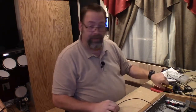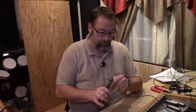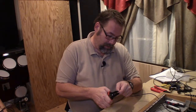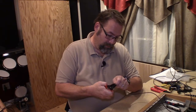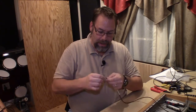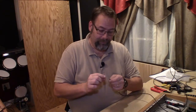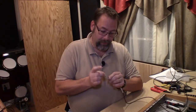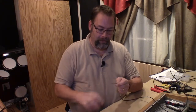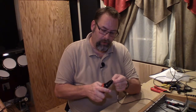You want to try to keep the table as clean as you can because it gets messy really fast, and when it's messy you can't find anything. Every time there's a little bit of trash, get it in the can. Now I'm going to strip the end of the wire — about an inch off the end of it. You could do more if you want; I find it's a little more comfortable to work at about an inch. Just cut it and pull it off. The thing about this Belden wire is that the shield foil is tight and you really have to work to get it off — Belden really is a good investment, it's the best there is.